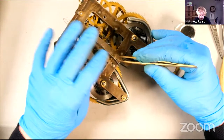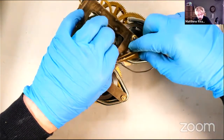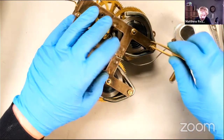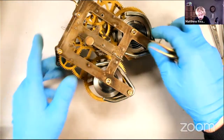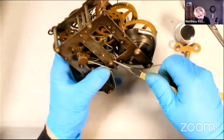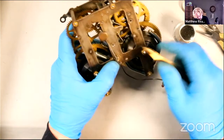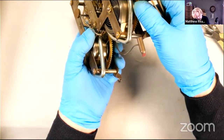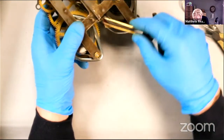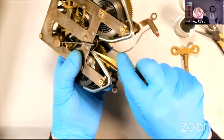Presumably, when you get more experienced and competent at these clocks, there are little tricks and fixes for doing this without having to kind of brutalize these springs, sort of putting them in place at the beginning rather than as I'm doing it now. You could put it around the stop for the mainspring, but I don't think that's the purpose of this. Well, that's not definitely the purpose of the stop, but I don't think that's going to help. Maybe it should be somewhere inside the plate. Yeah, let's just pop it up there and round that pillar instead. That'd be neater.